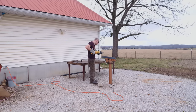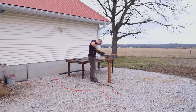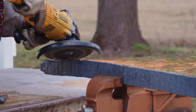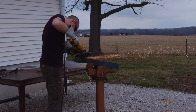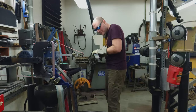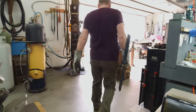I've waited as long as possible to grind these MIG welds off the edges so I could make multiple passes, drawing the billet out, stretching it, without having to worry about any of the little corners tearing open. The billet can lose too much heat, and it can put a lot of stress right on those tile welds, and you can get the very, very little corner kind of tear open on you or something. Now, I'm not sure the sheet metal is gone enough for us to be able to see the pattern there, but I don't want to grind off more than I need to either.